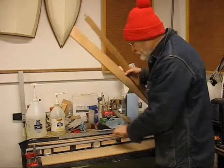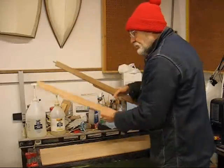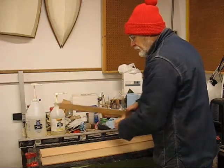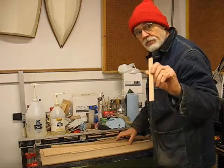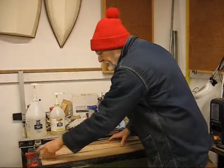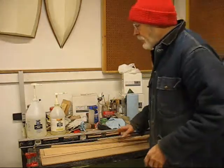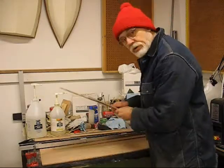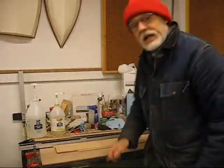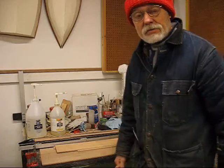I've used my level to make sure it's straight that way and flat all the way along. So now I've got this piece I can go ahead and epoxy in place. It's a little light on width, so I've got a couple pieces of narrower quarter-inch plywood that I'll fill in behind them. I'm not worried about this thing flexing because of the joint in the middle — there's going to be so many layers of epoxy on it it's going to be like one big brick. If you were concerned about that, on this joint underneath the next layer of plywood you could put down a layer of glass, wet out the glass, and then put the plywood down on top. That gives you some more strength and maybe some sleep easier at night.